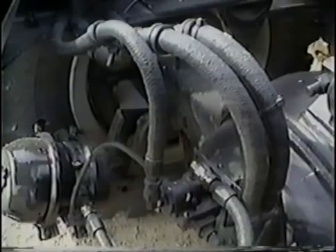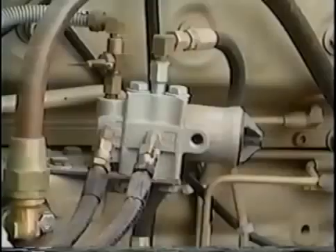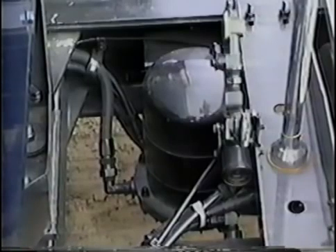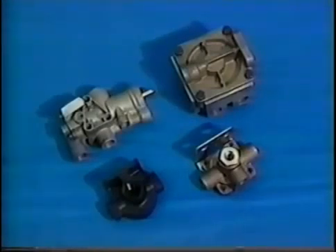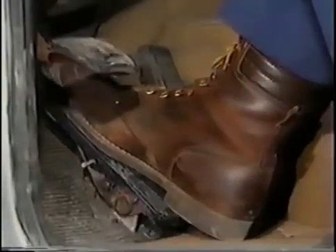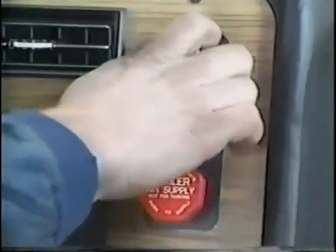Let's briefly review the components involved in routing compressed air to the brake chambers: a compressor supplies pressurized air; the governor regulates the compressor's output; an air dryer cools, filters, and dries the air; reservoirs on the tractor and trailer store compressed air until needed; a series of valves monitors, signals, relays, and directs air to brake components; hoses and tubing move air through the system; glad hands connect air supply from tractor to trailer; a foot pedal applies service brakes at each wheel; the hand valve applies trailer brakes only; dash control valves regulate spring brakes for parking and emergency braking; and finally air enters the brake chamber.